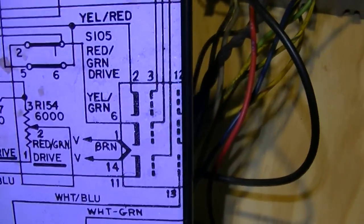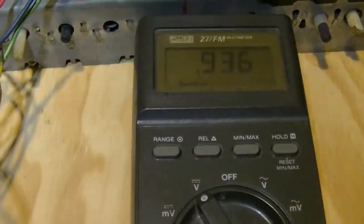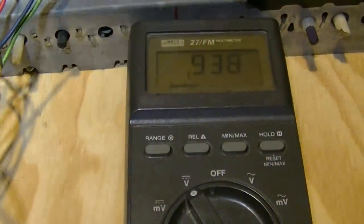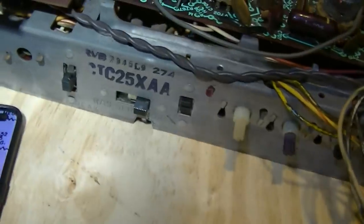Okay, here's a problem here. All the cathodes are measuring 0.9. And that's way too low. That would just turn the thing on 100%. So what is going on here? Where is our...